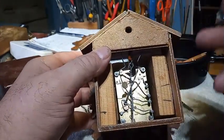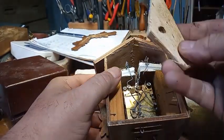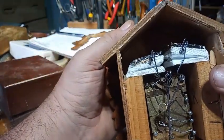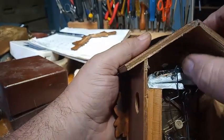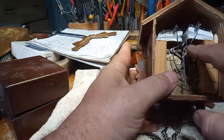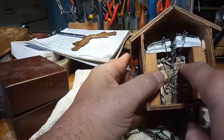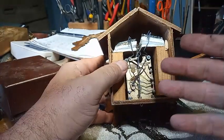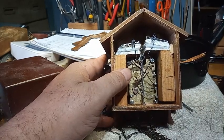After all that, I tested it out and it would not stop cuckooing. So I took it apart and undid this so I could look inside. What happened is the staple had come out of the cuckoo mount, which would not allow that piece of wire that trips this lever to work. So now I have to take it all back apart to attach that cuckoo mount.